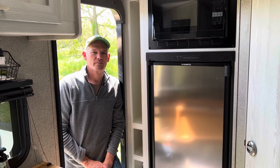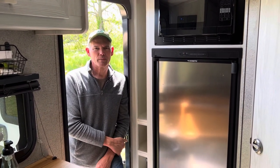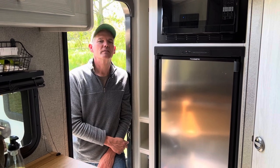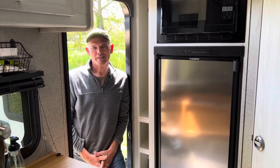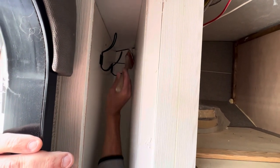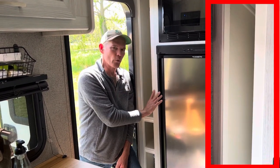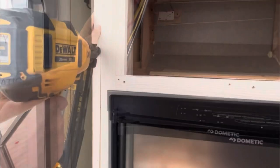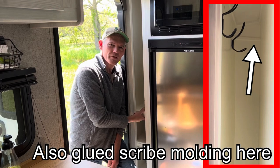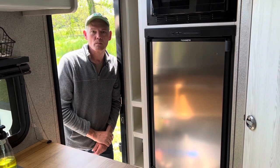Once that was installed, we did the finishing work. We wanted it to look like a built-in cubby that complimented the camper as much as possible. We had already primed and painted that quarter-inch panel and wall before installation. We also painted the back wall the same color so it would all look nice and finished. Then we trimmed it out with different pieces of wood casing - some scribe-like material run through the table saw, one-by material cut for width, and small window casing to create a waterfall effect to hide the supports fastened left and right for the shelves. The shelves were caulked in and have held up really well even with travel.